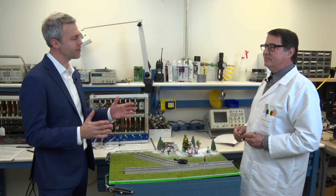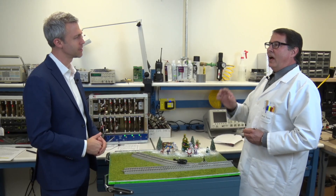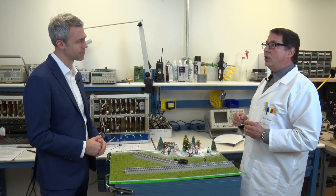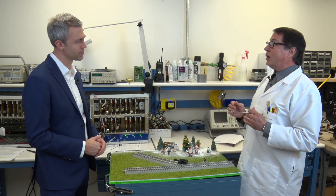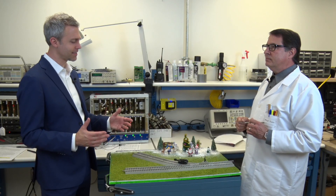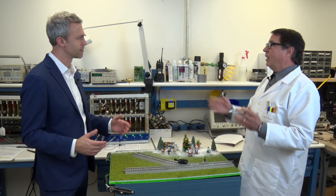But Professor Verne, how do we make sure the track switch works safely? The electric switch machines that move the switch points have multiple safety features. First, it checks for correspondence, meaning that the switch points are properly aligned. There's also a point detector that ensures no gap is present at the closed switch point. There are also lock rods — huge metal bars — that lock the switch points in place once the switch machine finishes its movement. So what happens if something isn't right? If either of these verifications fail, then trains will not be allowed to move over the track switch.